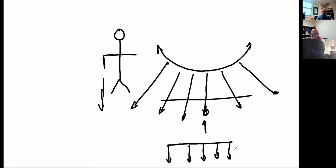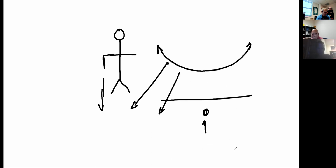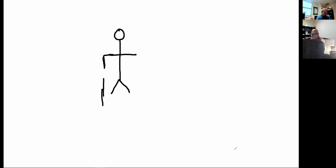The other part is, let me get rid of all this. I've seen a lot of people do this, especially on the depth. Like I said, depth's an estimate. If you want to use it for an estimate, fine. Don't tell another company, "Yeah, our conductor's at 3 feet," because they're going to take you. Would that make you liable? It definitely will. Well, the Santee Cooper guy came out and he said that conductor was at 3 feet and we hit it at 2. All right, so that's on you.